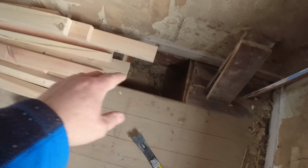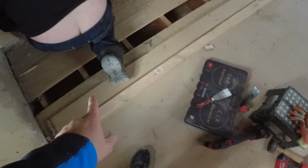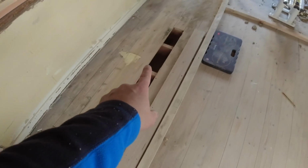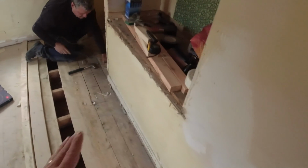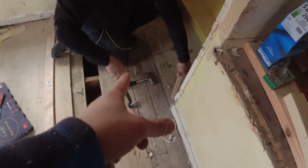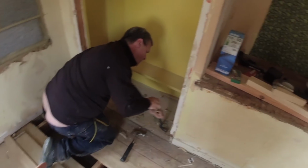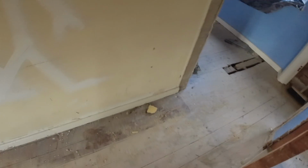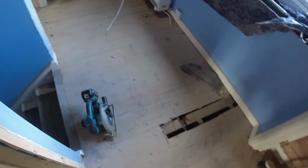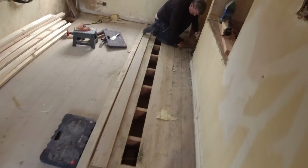Woo, woo, woo. When I pick the camera up, he starts working, yeah? So there's our route for our board. We start to get our route up through this corridor. We're going to carry this one on here. And then this is going to be a staircase, but this floor is not going to be changing, so we can, in theory, fish through for the bedroom. Save the cable length and save drilling too many holes through these joists, yeah? Don't ever drill 4-inch holes through the joists, yeah?